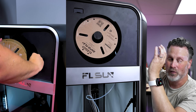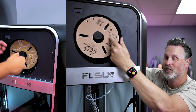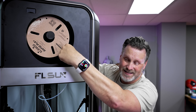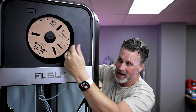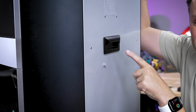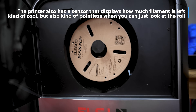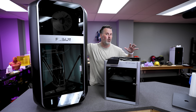It is kind of a pain to load the filament in, specifically into the PTFE tube. I've had numerous issues with brand new rolls where the filament ends up flipping over the front side of the roll — it's a really big pain to work with. A potential fix is adding a longer PTFE tube. Also, Modbot let me know there's actually an entry point on the side of the machine, so you can side-mount spools — even larger 3kg or 5kg rolls — and feed that directly into the printer.